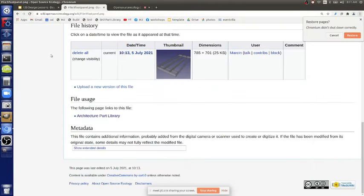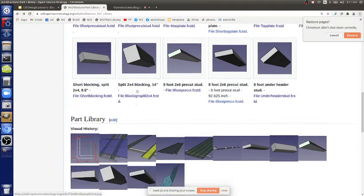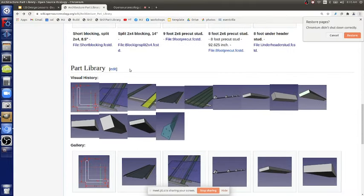So we're hacking the system at all times, and this is where we have to make sure that, in the exact build process that we do, we make it through the codes, because there's a particular inspection schedule. For example, for electrical, you have to have the framing and all the electrical exposed. Yeah, we can do that, because we leave the interior panel off until the very end, until we're actually finishing the inside. So the inspector will actually see all the wires running through the walls.